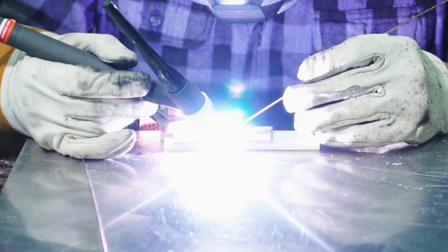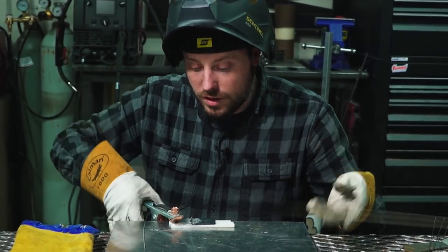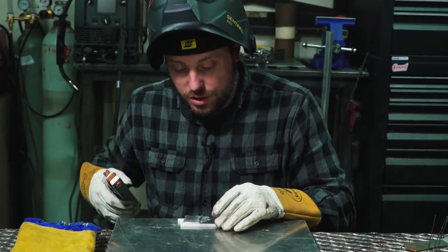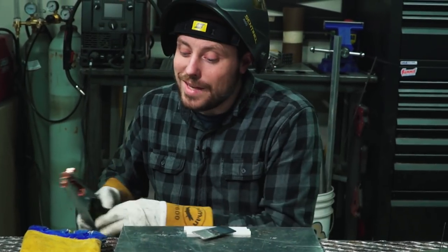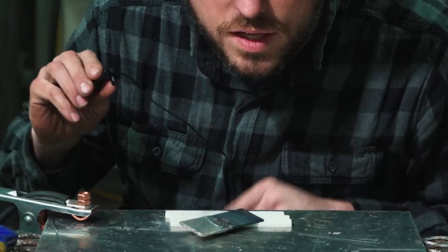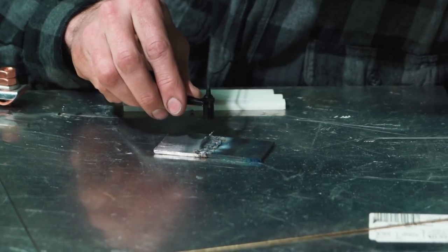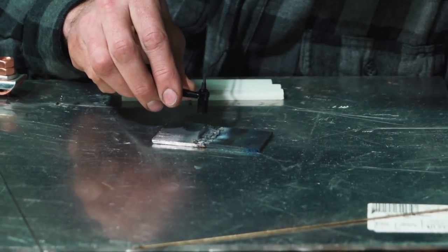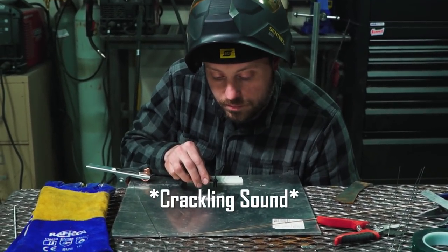It's not pretty, but it's holding somewhat. I put a ton of silicon bronze into it and watched the whole plate of aluminum melt — I could see the rod as it pushed into the aluminum. So if this is ever going to work, it'll be this time. If you do just a nice even braze, it does this right away. You hear that? That's the weld separating — you can hear the metal separating as it cools.